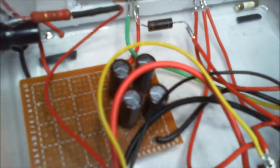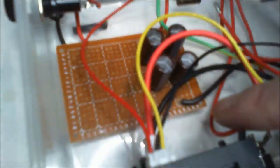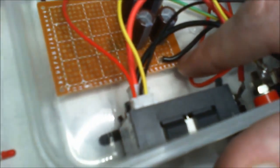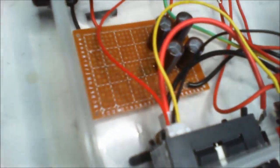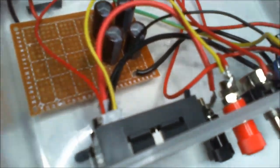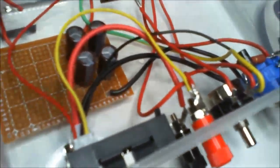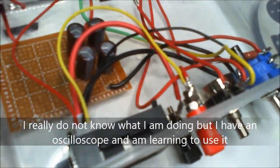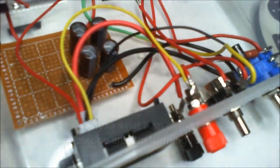that's all there is for the output. I've just concentrated on the input there, and I'm going to see what the difference is on this. Now this I can take out easily. It's blue tacked down. Well, it's not blue tack, it's a different brand name, but it's the same sort of thing. Wacky tack or something, I don't know what it's called. But it means I can get at it, and I can put output capacitors on here if I want to, or I could even put another board here, output capacitors there. But we're going to see just how this thing rolls, and I'm going to do some load test type thing and see what the noise is like with and without the boost converter, and maybe even with and without the capacitors.